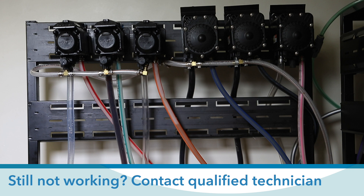If you find low pressure on the water side, it could be the result of a clogged filter cartridge. Have a qualified technician check and, if necessary, change the filter cartridge. If the low pressure is on the syrup side, it could mean an empty BIB container, an improper regulator setting, or a low CO2 gas supply. If the problem is with either the regulator pressure or the CO2 supply, contact a qualified technician for further assistance.